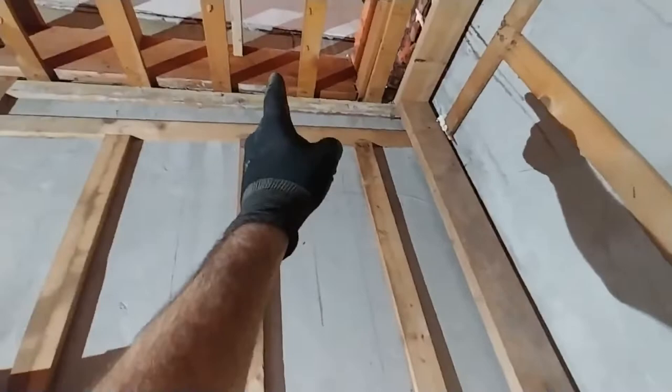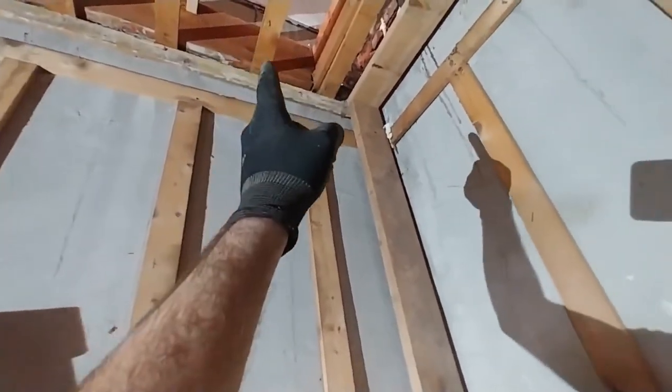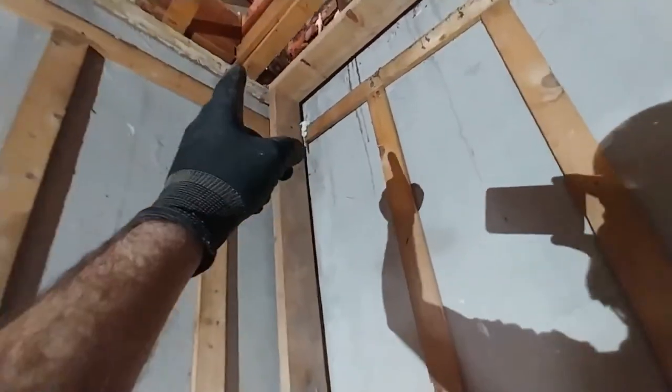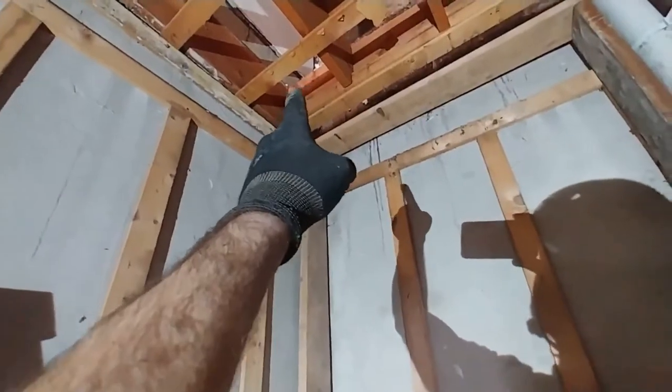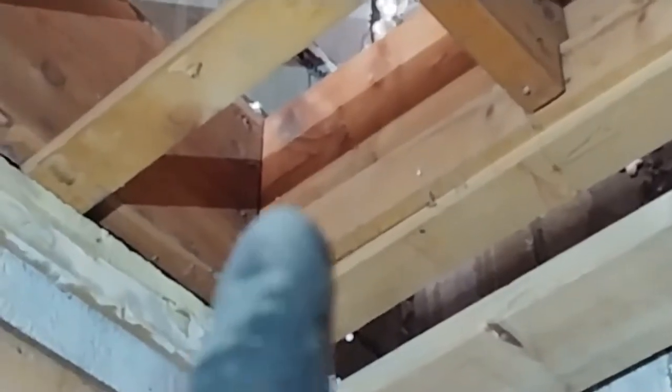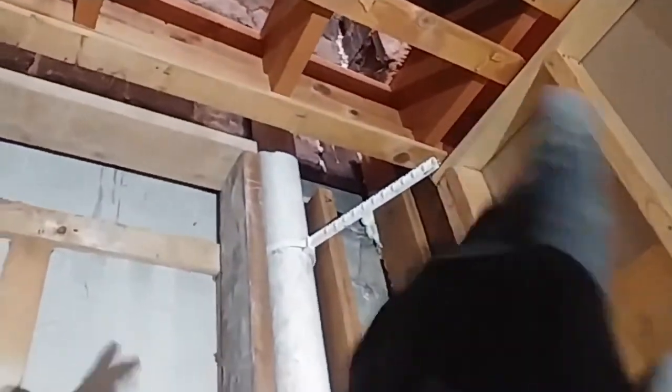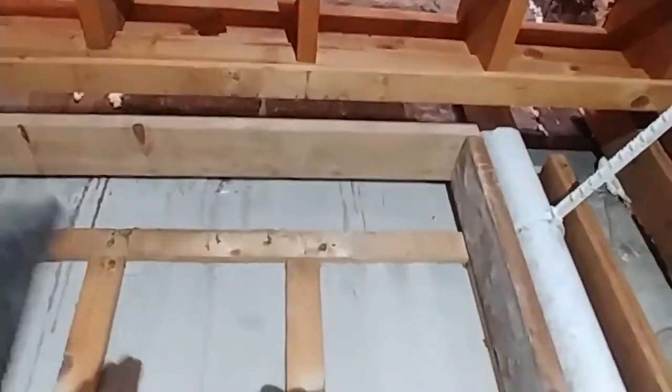The joists for this floor come over and don't sit on anything. The rim joist is attached to the concrete wall, and then the other rim joist is only attached to that, and it's some kind of fakakta notching situation and split up there as well, where the furring strip is notched into it, and then there is split, and the weight of this joist and this joist and this joist and this joist are hanging on a single 2x12, and he's getting away with it so far, but essentially it should be a double, and it should sit on something over here that it's not on.